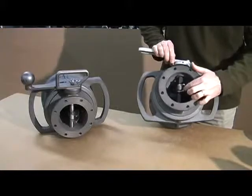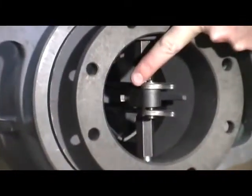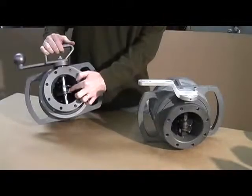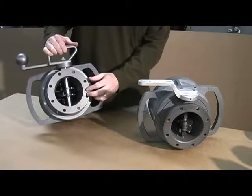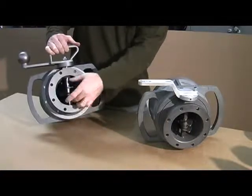The drive link is a critical component in that it centers the links on the shaft. If that thread is not tightened properly, the drive link could slide, which could cause a failure in the field. With the D3, we've eliminated the threaded drive link — it's held in place with a spacer, so there's no way that the drive link can move on the shaft.